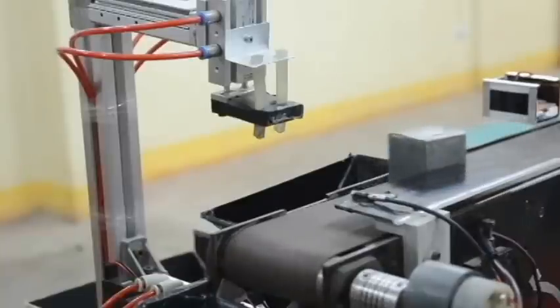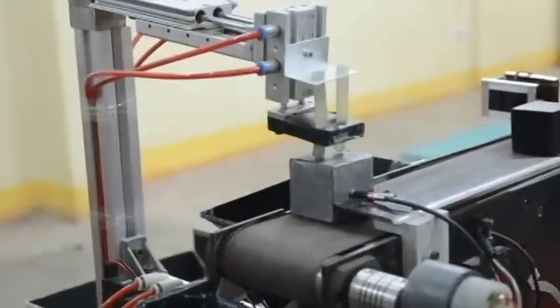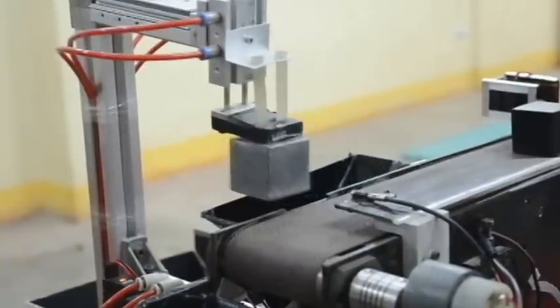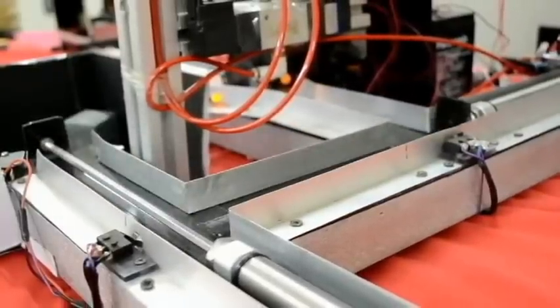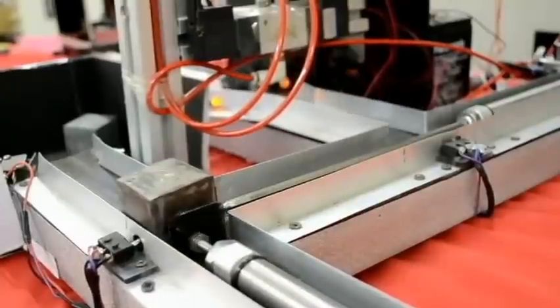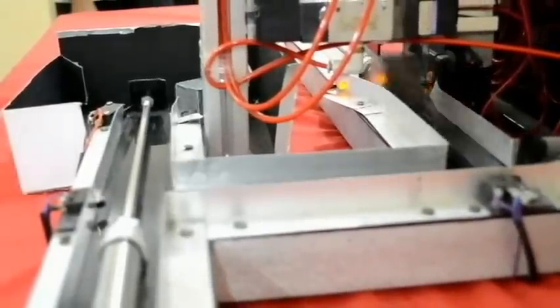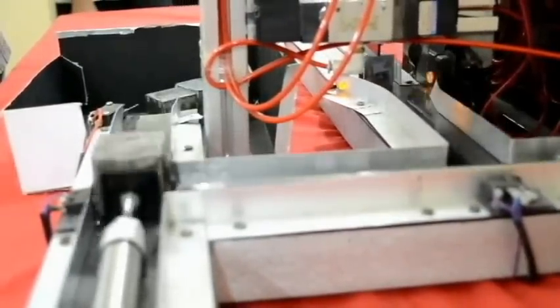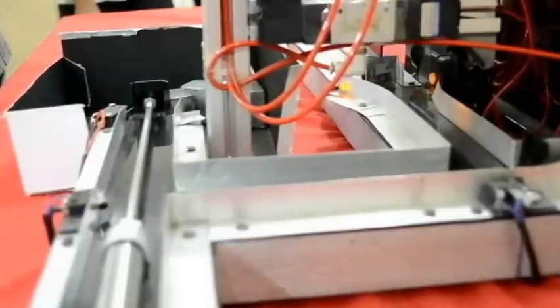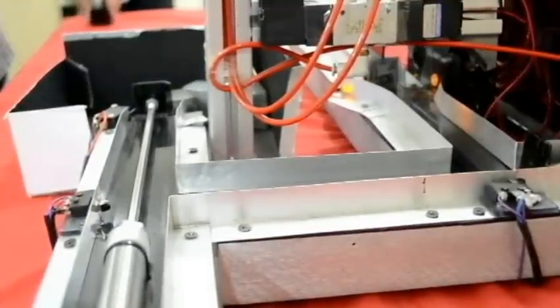The metal object from the pick-and-place process will then be placed in the material storage, where there is a light-dependent resistor. When the object blocks the light between the LED and the LDR, the PLC will be triggered to perform its operation. The first double-acting cylinder will extend, transporting the material to the first roller switch to activate the second cylinder. The process repeats up to the third cylinder.